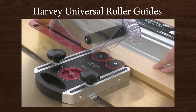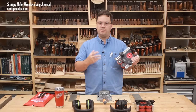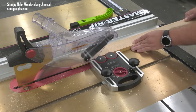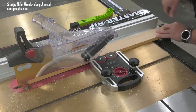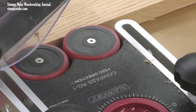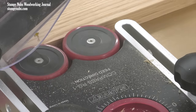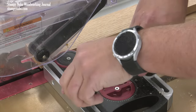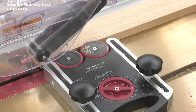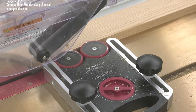The Harvey Universal Roller Guides are one of the coolest tools we've ever had on this series. You really have to see how they work. They are roller guides for the table saw or the router table. Basically, they function like a feather board to hold a workpiece against a fence for safer, more accurate cuts without chatter and kickback. But these have some clever features that no feather board can compete with. The rollers contain one-way bearings, which, when combined with the grippy tires, really put the brake on potential kickbacks. The pressure is adjustable, not just in the way that you lock it in place, but you can actually dial in more or less pressure after it's been mounted. This makes them much easier to set up properly, and it eliminates a problem that I often have with feather boards.